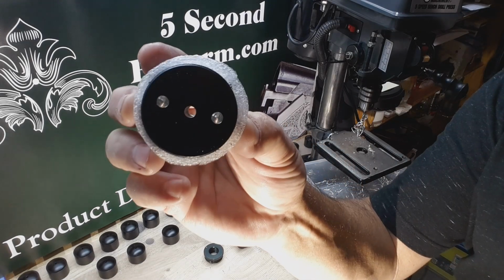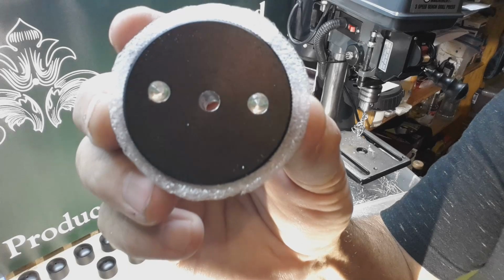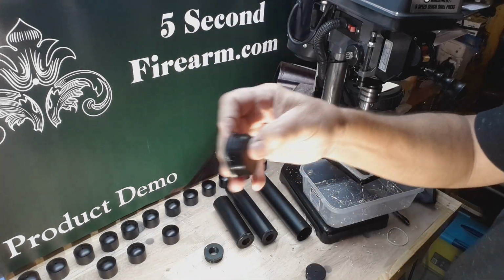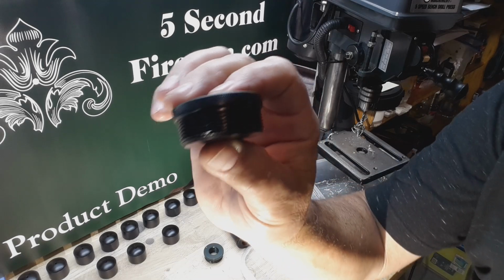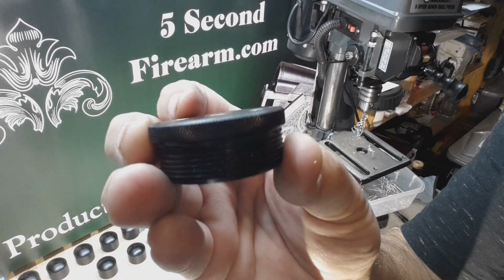Okay, so if you have a two-pronged tool that's used to tighten and loosen, because of the thickness of this end cap, which is 18 millimeters for SAE, around 3/4 of an inch, then you have enough thickness to actually put your tool holes in there.